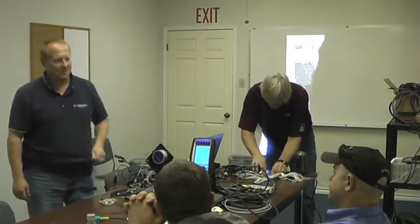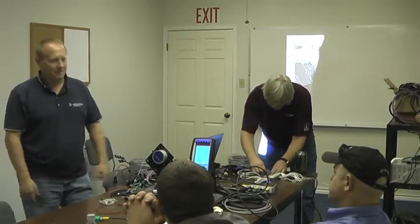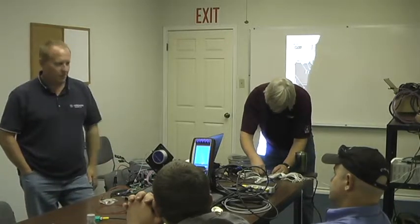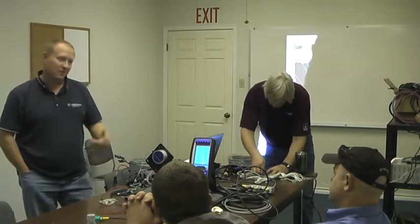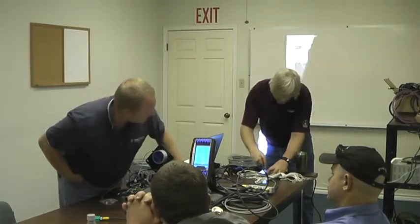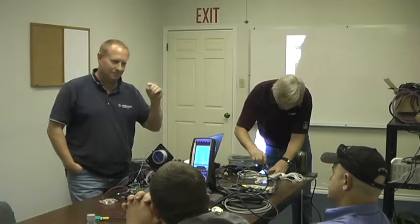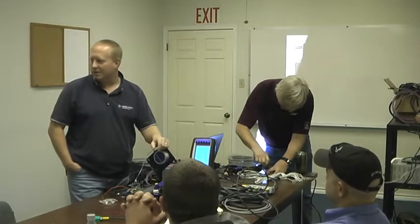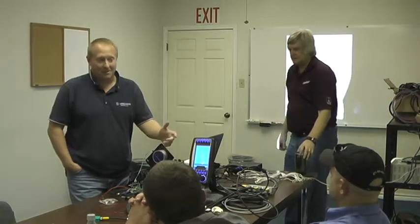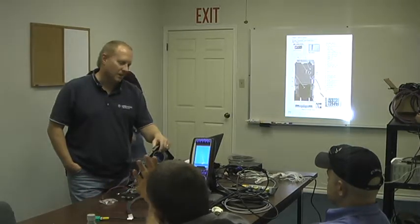Actually, setting wise, honest to God, it'll take you 5 minutes. The longest part's going to be telescoping out. Right now, there's no transducer set zeros settings, so you don't have to go track the lines. Because what we find is, quality wise, when they set these up, we're talking millivolt difference from one to the other. So at this point in time, it's been determined a millivolt isn't going to make a difference in your load display at all. So we're not going that route.